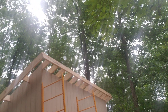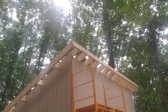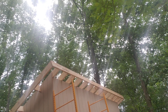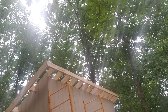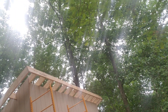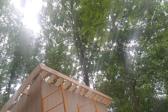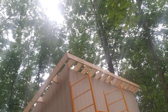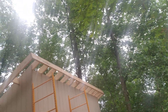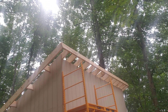So what I did is I took two 10-footers and installed them off of the middle rafter — there are 13 rafters, so the seventh one in from this side. I just ran them outwards, made sure everything was level with the other rafters, and then cut the excess off. So I have two 10-footers cut down to nine feet each.